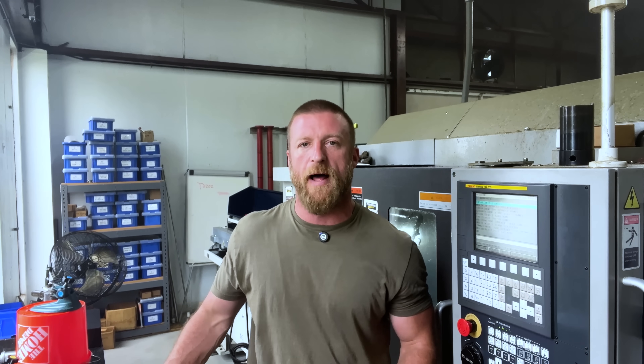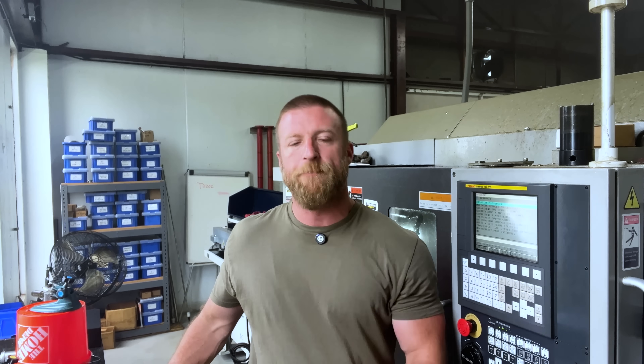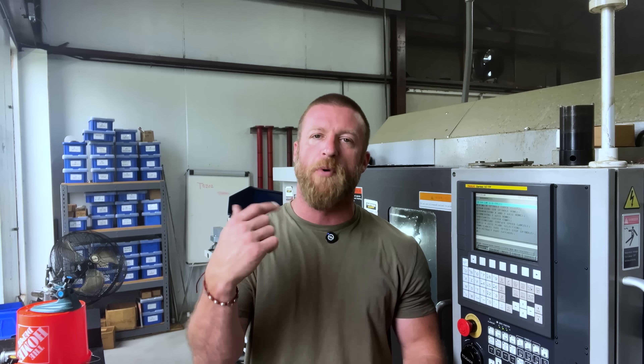Let's extrapolate that out a little further. If you have a part with 90-degree OD grooves, you're going to use a grooving tool. What's not as obvious: say you have a two-inch bore to make at plus or minus five thou. You would not use a one-inch drill and then use your finish bore to take all that material off in one shot. You want to use the biggest drill possible, then rough bore it out, and come in with the finish bore. That's proper tool selection.